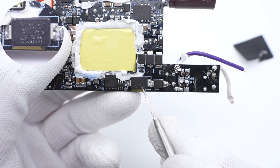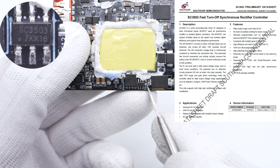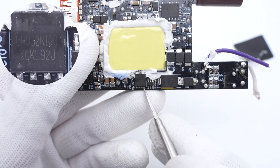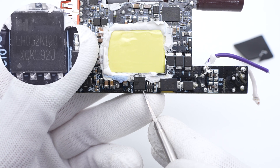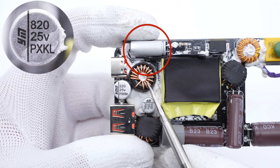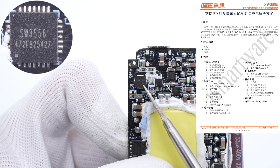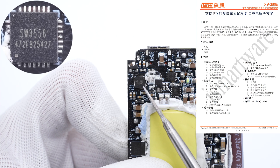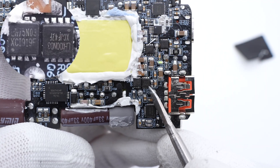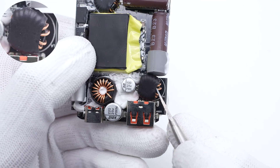The SMD Y-capacitors are both from TRX but in different models. Moving to the synchronous rectification circuit: the controller is from South Chip, supporting adaptive turn-on detection and fast turn-off. The synchronous rectifier is from Lihou Micro in a DFN 5x6 package with 100V withstand voltage. The solid capacitor for output filtering is from Yongming MPX series, 820μF 25V. There are two protocol chips for the two output ports, both from iSmartware SW3556, supporting dual-port control and a variety of fast charging protocols. The two buck MOSFETs are from Lihou Micro but in different models, and the two buck inductors for USB-C and USB-A output ports are insulated with heat shrinkable tubing.